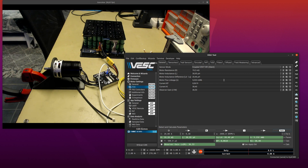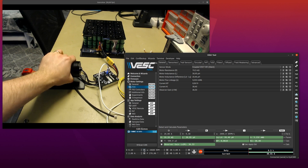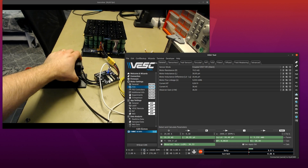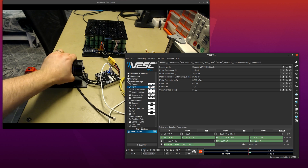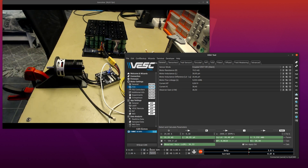That is a big advantage of this method. Now one disadvantage is that it doesn't work as well when you start to saturate the motor. At 60 amps it's kind of still working but it loses it quite a bit sometimes, and if you do more than 60 amps it doesn't work equally well anymore. But below that — say 40 amps — that's no problem at all. So if you don't need the full torque then this method might be a better choice because it's a bit more stable.